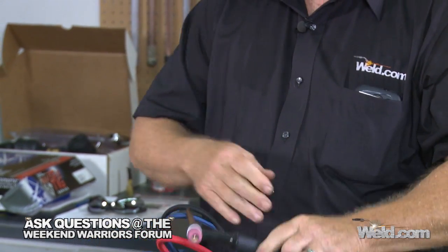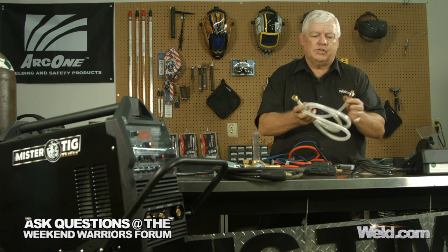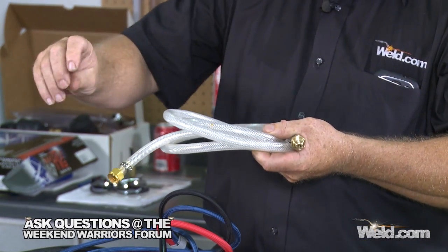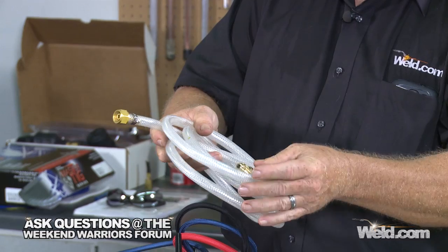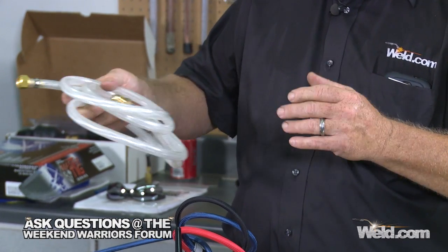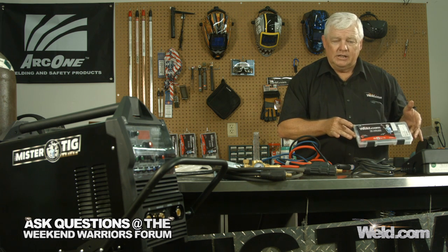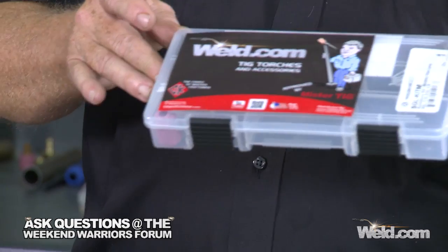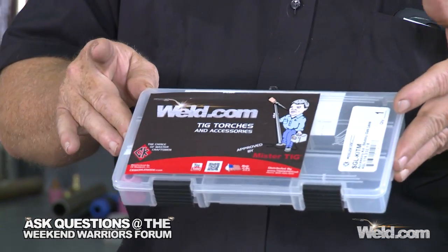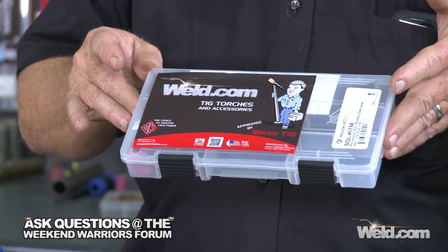This is the key to successful welding: having a good water-cooled torch with a nice flexible head — that's going to come as standard. I have here the argon line, and we've now gone to solid fittings so you don't have to slip on and tighten little worm clamps. You're also going to get a gas lens kit. The difference with a water-cooled system is you get all the way up to 1/8 inch tungsten — the 0.040, 1/16, 3/32, and also the 1/8 — because you're going to be welding at high amperages and you want tungsten that'll handle it.